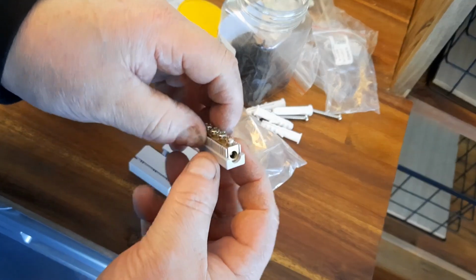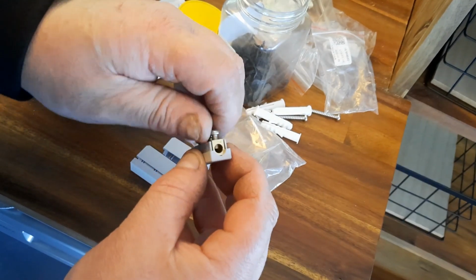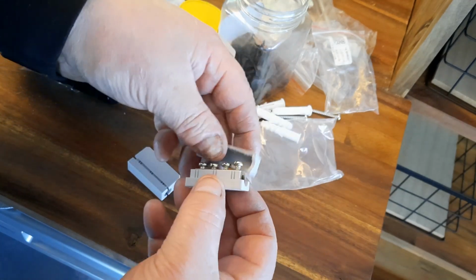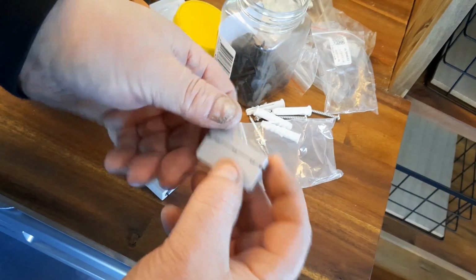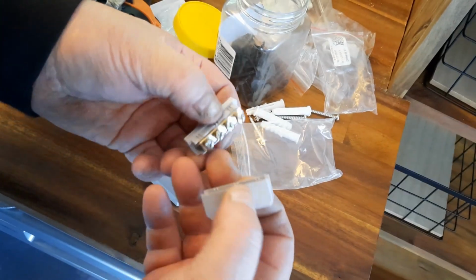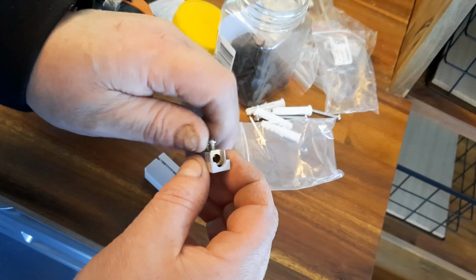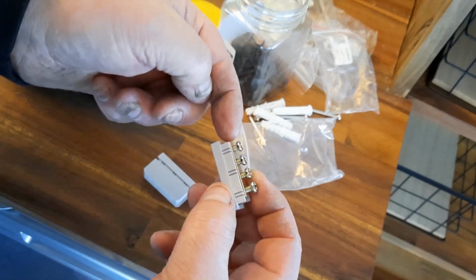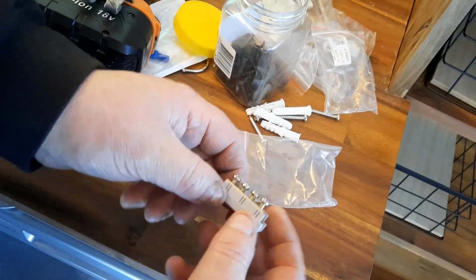Okay, so it's just more or less a brass joiner. So I'll just undo that. One part of the wire will go in there, and the other part will go in there, and then we just put that over the top, and that actually stops anything arcing out or them two joining. If they touch each other, it doesn't matter. So that's what I'm using. I got these off AliExpress. So it's just an insulated joiner. I'll probably go the wire for the 2 screws, and then the other wire will go in for the other 2. Then we do them up and push them on. It's easy. So I'm going to do that at the end there.